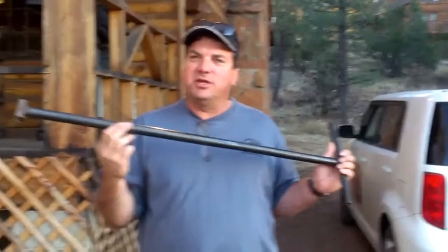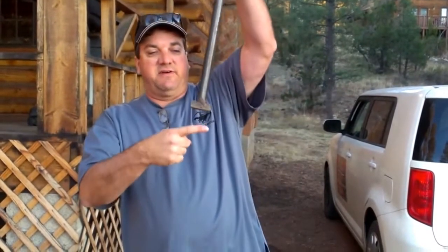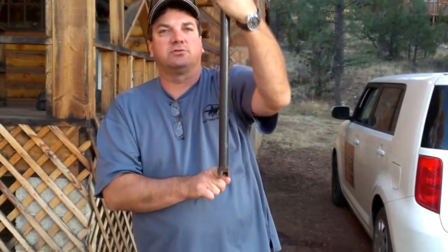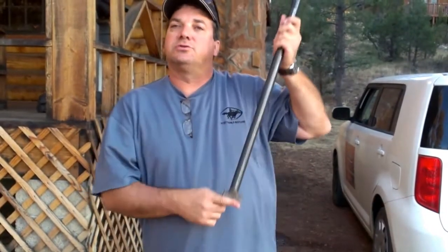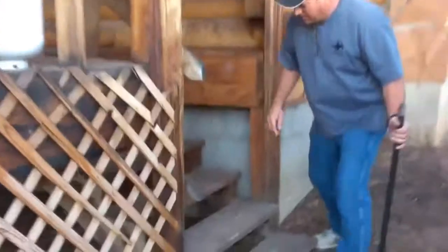First things when you unlock the door and you're ready to turn on the water, you're going to go into the kitchen and grab this water turn-on device — it's in the closet and you're going to see in this video where that closet is. This is the device. The water turn-on valve is right near the street where you just passed. There's a little peg down in the hole and you put this device over the peg and turn it a quarter turn — it'll only turn a quarter turn in two different directions. Before you do that, underneath these steps are two water valves and right now they are open — you're going to need to close them both.